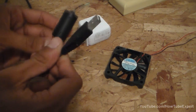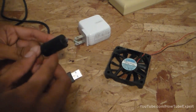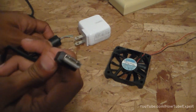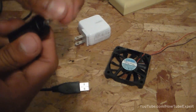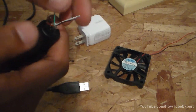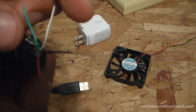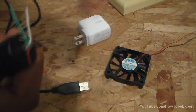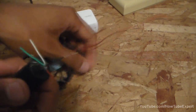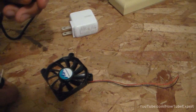All you need is a USB cable too. Get one you don't need and cut the USB cable — cut the other end, not the USB part. You're going to have cables: there's going to be a green — you don't need it — a red that you do need, a white you don't need, and a black. You only need red and black on both sides.